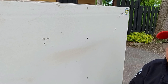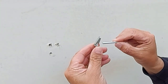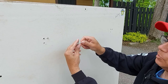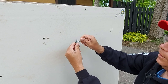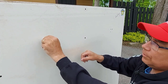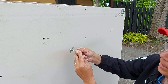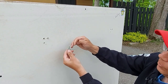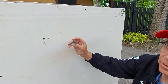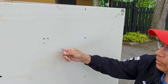Now here's the trick — we're going to be using a toggle bolt like this. What's going to happen is we put the bolt in here into this spring-loaded toggle, then you squeeze it through and put it through the holes. When it gets on the other side it's going to spring-load open like that, and when you tighten the object you're mounting, it grabs the wall and that's never coming out of there. Your towel bar will never come loose again.